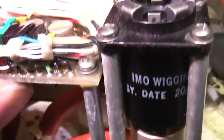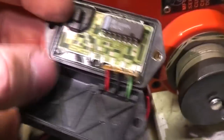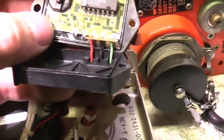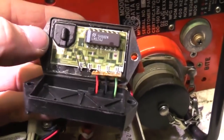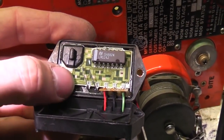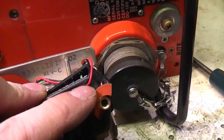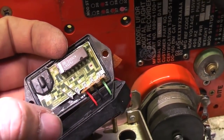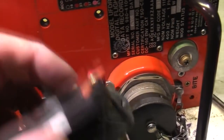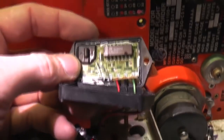Let's take a closer look at this pressure sensor board. There's some electronics here - a hybrid module with laser trim resistors for calibration. These pressure sensors are likely a silicon bridge type, which is the normal type - they're quite sensitive to temperature and have quite a lot of part variation so they need quite a lot of calibration. There's a separate set of wires going in here - I don't know if maybe that's a temperature sensor. This whole top is potted so I don't think there's really anything I can do to get any further into that.